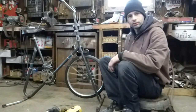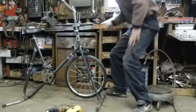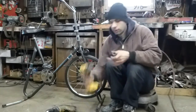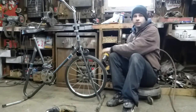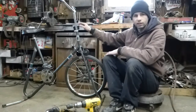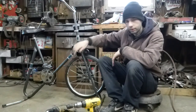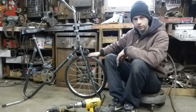So how I'm going to do it is use this exercise bike wheel here for the load and the RPM. I got this little rubber wheel I can run along the wheel with it. And I know the speedometer is not going to be very accurate for this test, so I rigged up a little clicker here that measures how many rotations it does.